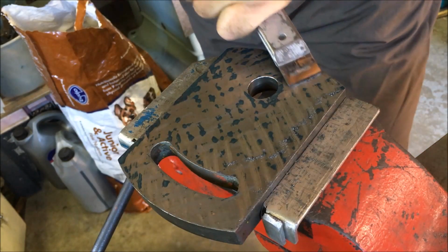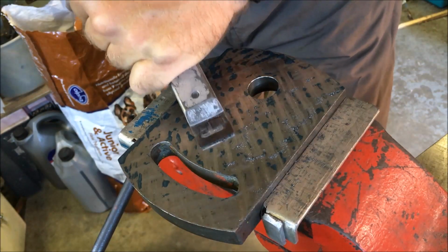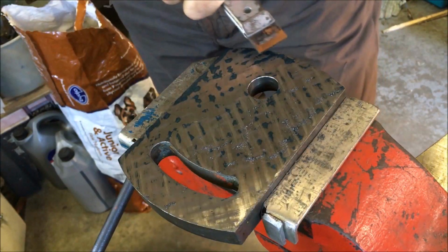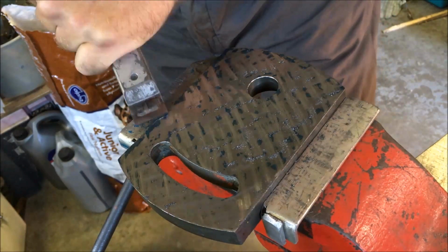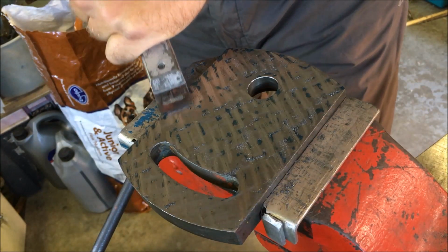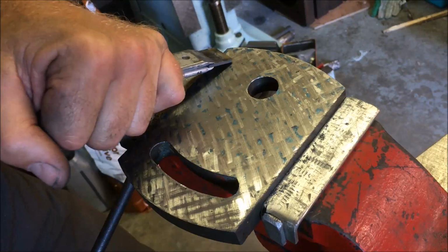And by the look of the scrape, this tip edge wants honing, a bit like a serrated edge, or a ploughed field, as somebody remarked on another thread on Practical Machinist. Now I could probably have just stuck this in a shaper and got a perfectly adequate finish on it. I wanted to scrape it.